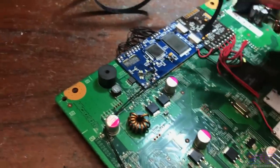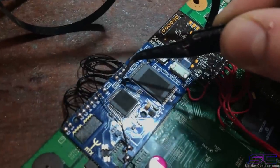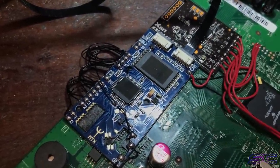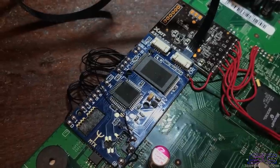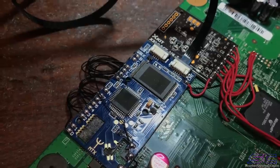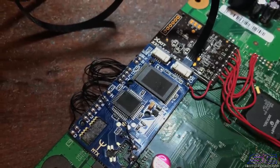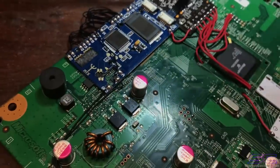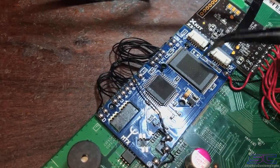I'll show you guys underneath the board in a minute. It goes to this pad right here, and the Demon has a pad called the LED pad. That pad switches from ground to 3 volts. When the console is on the retail NAND, it's at 3 volts. When it's not on the retail NAND, it switches to the 16 megabyte on the dual NAND and sends a ground to that pad. When it goes to ground, it turns that LED on the back of the switch - that blue LED - and it also enables those resistors on the bottom, giving them a ground.